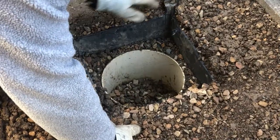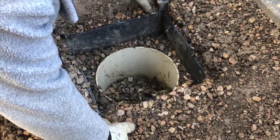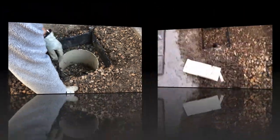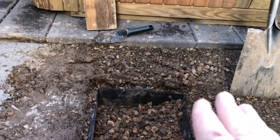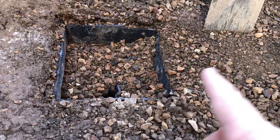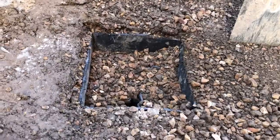So we've chopped all that away and I do need to break these away as well so they end up below the paver. We'll fill all this with stone and that drain will still be fully accessible — the water can easily get down there, come from the sides. You can see there's a stone layer under here as well so the water can come in here, so the drain will just work like a French drain. We've got it partially filled — you can see I actually put the plastic off-cuts in there as well, in front of the pipes, just to make sure the stones don't fill the pipes. Being stones it wouldn't actually matter, but just to keep that all open. Then we filled up with stones and we'll level that off and lay the paver straight on top.